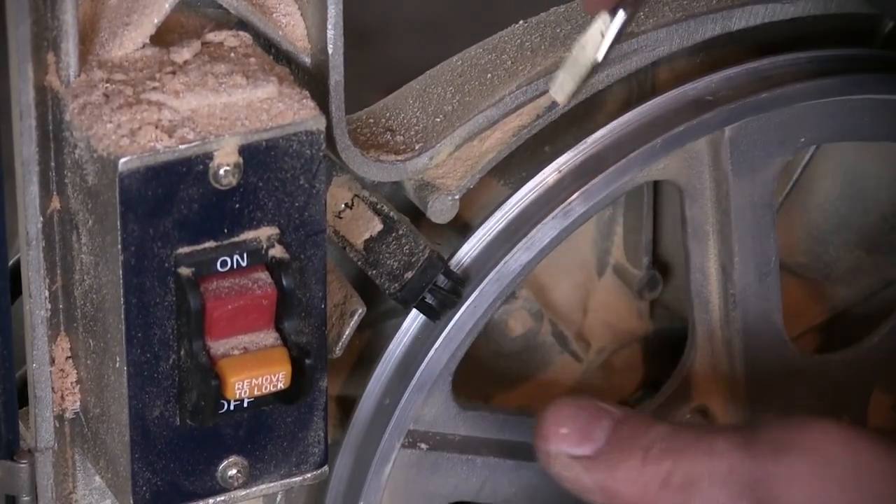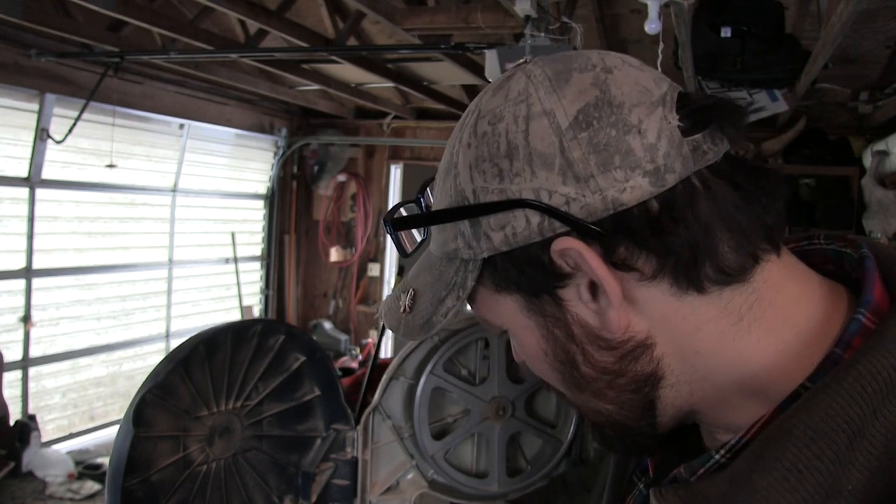What I've had good luck with in the past when it comes to replacing bandsaw tires is real simple, but it does work: electrical tape. This is a half-inch wide roll — it's a smaller roll that comes in a variety pack with white, green, blue, and red. That's perfect — it fits right in that track. I'm just going to start laying that electrical tape in there and building up a thickness. That blade will run just fine on there. The last saw I did this with — I replaced the upper and lower tire on the wheel and it lasted for years. Never had a problem with it.